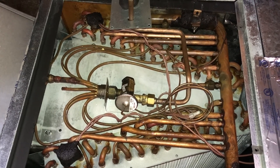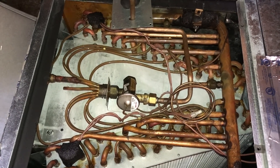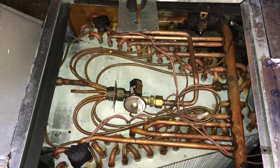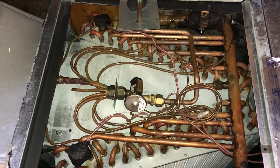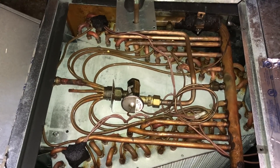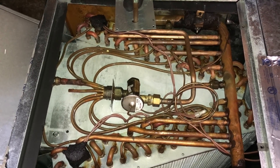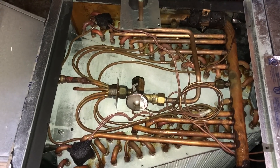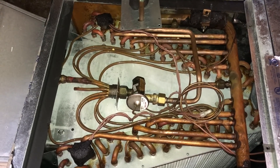Unfortunately, this coil has to freeze evenly when you pull the fan off of it. Right now I've got the fan unenergized, so all I'm doing is running this system with just the compressors running outside — my indoor blower is off. We're just going to watch and let it freeze up because we want to make sure that the whole coil is going to freeze evenly. If not, this coil is restricted.